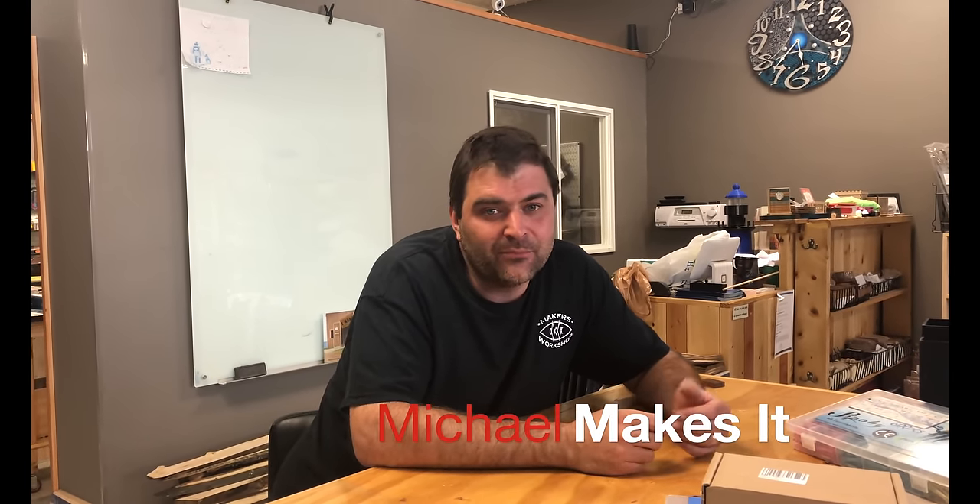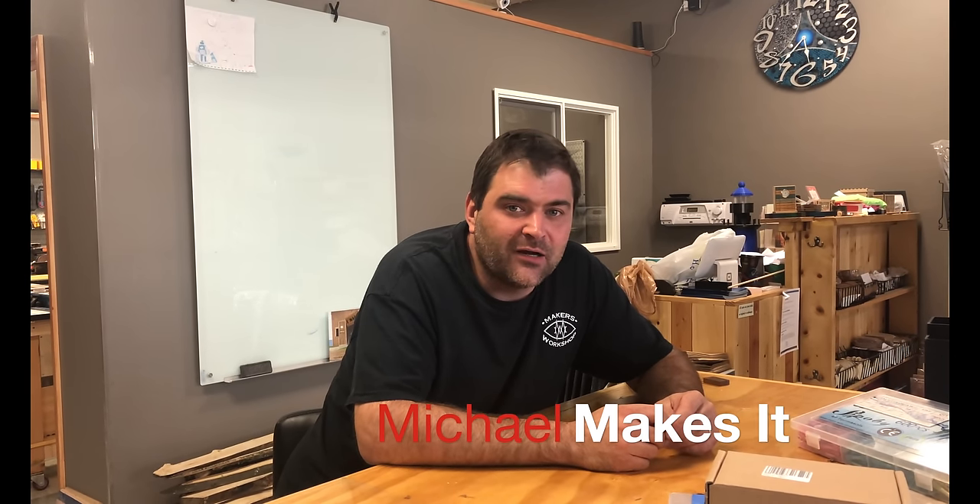This is the second installment in a series of three videos showing you how I mill my own lumber. Today we're going to cover different ways to speed up the drying process. At this point we've milled our lumber and now we need it to dry so that we can use it. It can take up to two years to dry a two-inch slab using natural methods like putting it outside, so I'm going to show you a couple methods that I've used in the past to speed that up to two months depending on the method and the thickness of the slab. Let's get started.